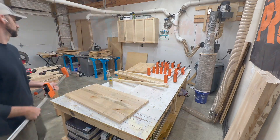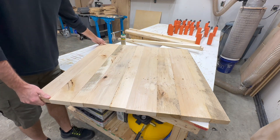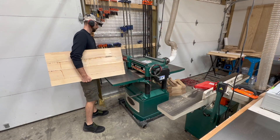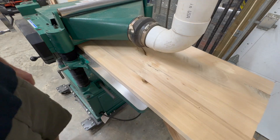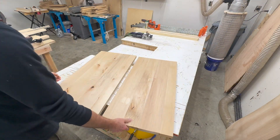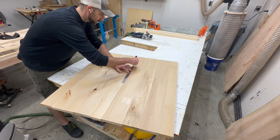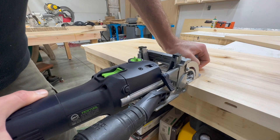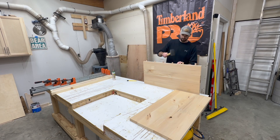When putting a smaller tabletop like this together I usually don't use dowels or dominoes for alignment, because I'm going to run both slabs through my planer to smooth out any imperfections. If you don't have access to a wider planer you could use biscuits, dowels, or another joinery method to make sure the seam lines up. For the center joint — which obviously won't fit through my planer — I have to get that seam perfect, so I'll use dominoes just for alignment. The strength from this joint comes from the glue seam itself; the dominoes just help line everything up.